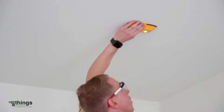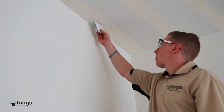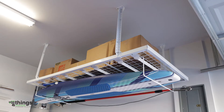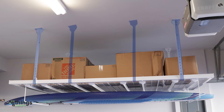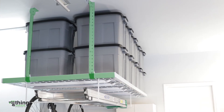Locate the studs in the ceiling with a stud finder to determine which direction they are running. The ceiling brackets always run parallel to the existing studs. We designed our heavy duty 4 foot by 8 foot ceiling storage unit so that the down rods could be located anywhere on the perimeter of the rail system to adapt to any stud or truss configuration. The down rods are most often secured to the 8 foot rails but they can also be attached to the 4 foot rails when necessary.